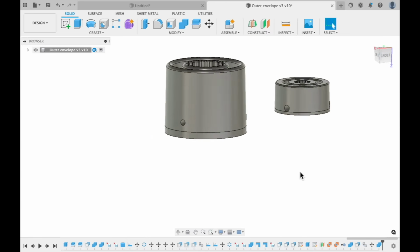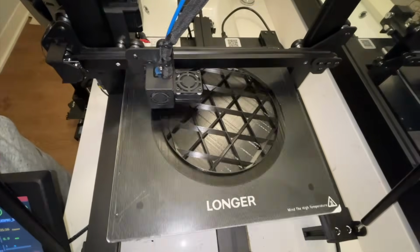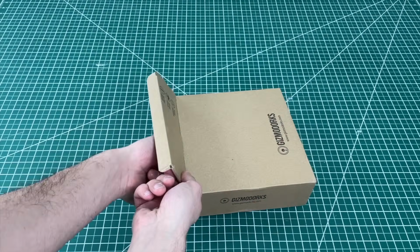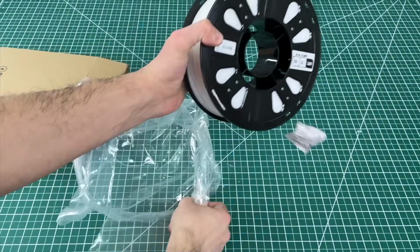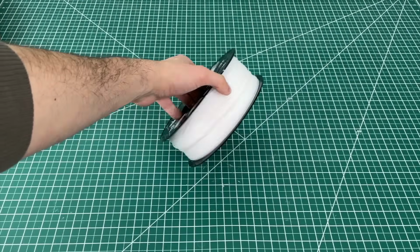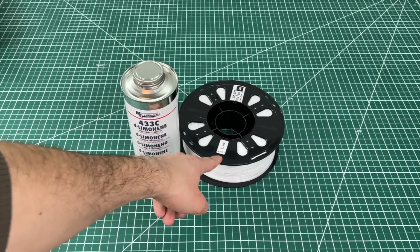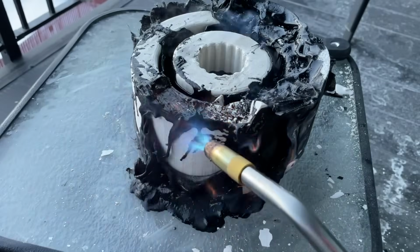We added 2 extra holes in our design to accommodate the extra torches, and this time decided to print it with just 1% infill to cut on printing time. We also decided to try using HIPS instead of PLA plastic. HIPS is a soluble plastic that should completely dissolve away in the solvent called D-limonene. We're hoping that by submerging the entire mold in this stuff when the foundry is cured, the plastic will just dissolve away so we don't have to use the propane torch method.